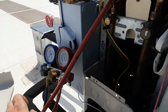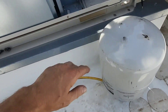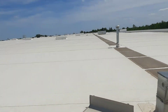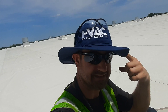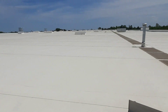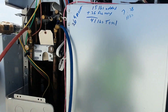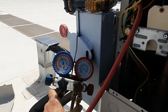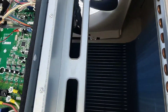I think this guy's gonna be all right. I'm gonna have to go get some more refrigerant — take the long trek back up here. It's not even that high, but it's high. Shout out to the crew — these hats are necessary in this heat, especially on these white roofs. This compressor keeps ramping up. If you can hear that change in sound, it's gonna start sounding more normal by the time I get enough refrigerant in it to work. Then we're just gonna have to spend some time leak checking.